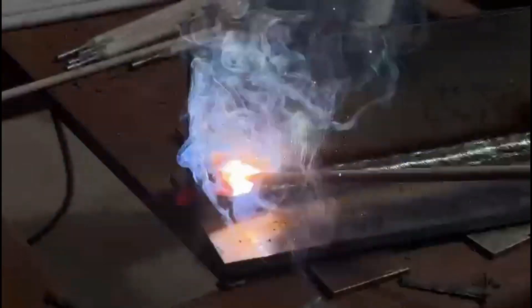Now moving off to our next run, laying that on the top. We've dropped our angle down because we need to push that into the back plate and fuse into it, covering half the previous run. Hopefully we now have achieved a 45-degree profile. You use the same technique regardless of the fillet size — layering up every single time, making sure that you've got the positions right so that you're achieving that 45-degree profile.